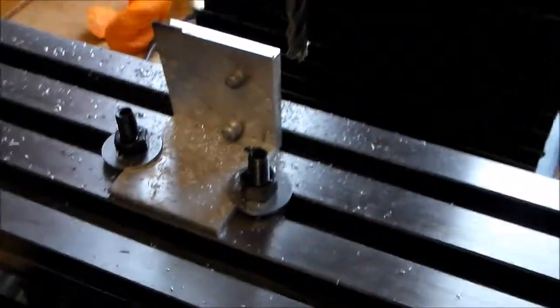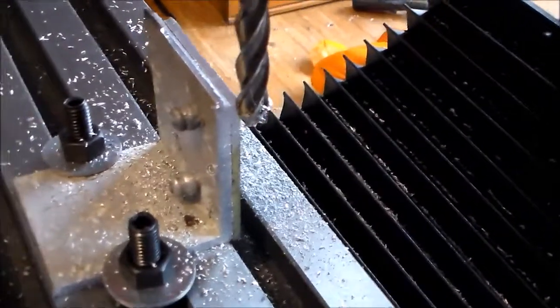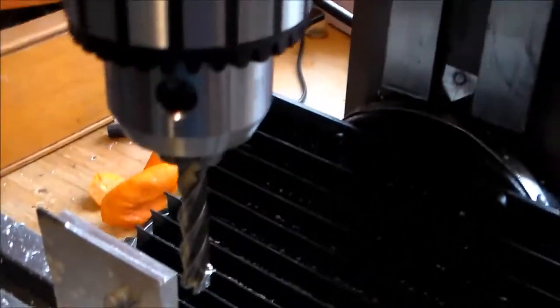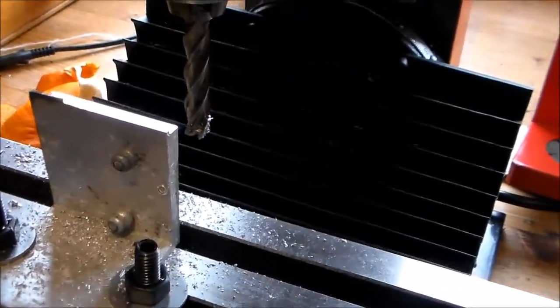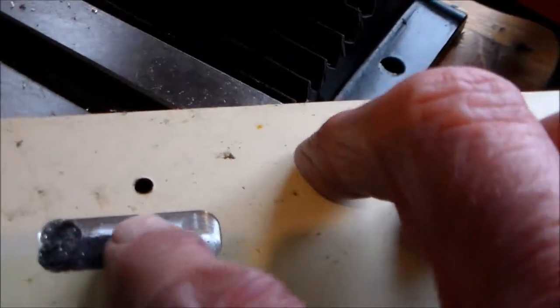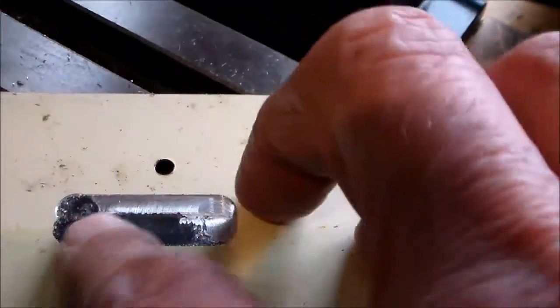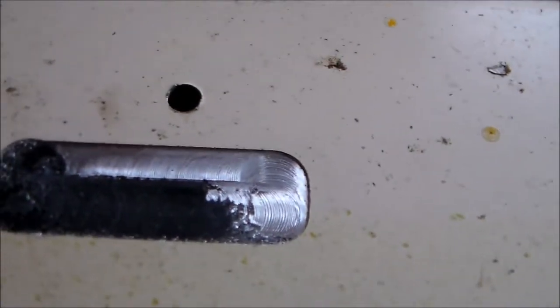If I step back from it, what you can see is it's just a piece of scrap angle aluminium clamped in there. I've done an experiment to see how well I can cut aluminium — no measurement, no set-up, just clamped it on and took a couple of delicate test cuts to see that it will work. My very first cut was through a sheet of aluminium-clad plastic material, used for some building projects on the garden railway, and I just machined off some of the aluminium using the end mill, doing a very shallow cut, just to practise using the dials and doing some cutting on the machine.